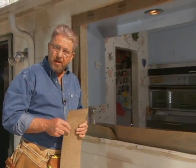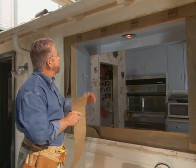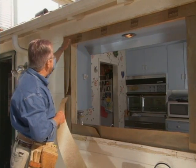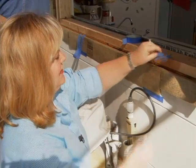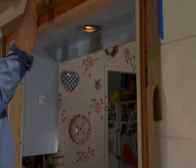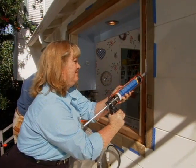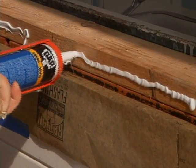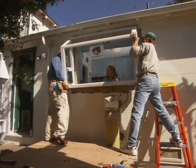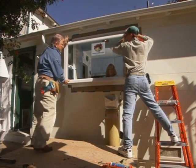To make sure the new garden window is watertight, we'll be using two materials: caulking, which we'll apply later, and waterproof flashing paper. I've inserted the flashing paper behind the sheathing and made sure each section overlaps. We fold the flashing paper back over the siding and tape it down to make way for the fin around the edge of the window. Jenny then spreads a heavy bead of silicone caulk around the edge of the opening for a good seal between the window fin and the framing.